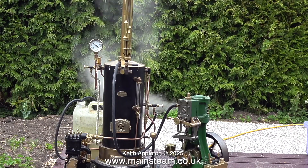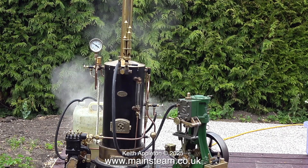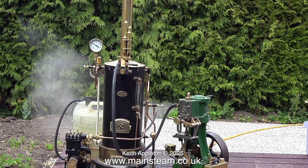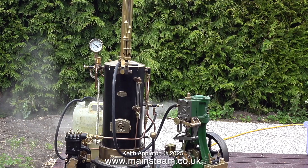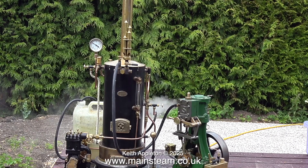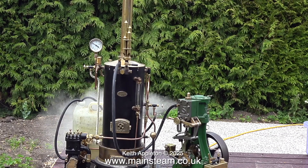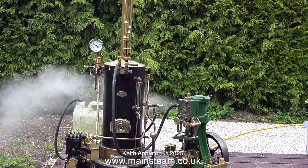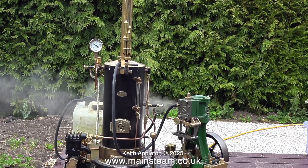Get all four of these things right and you can have constant running at good power levels. Really though, a six inch diameter boiler of this height is a little bit small for a 5A. The larger the boiler the more water it holds, and generally if it's a coal-fired boiler the heat is intense. Gas-fired boilers are okay and very convenient. A propane-fired boiler would be quite good, but I really don't like the idea of having a high-explosive tank next to a boiler in a small confined space. And the smell of coal and oil in a steam plant is really good.